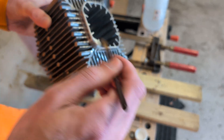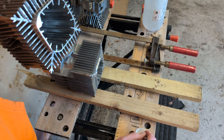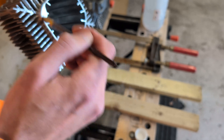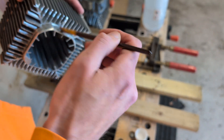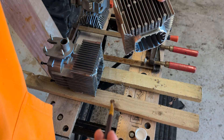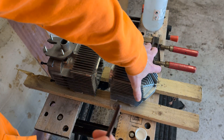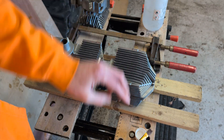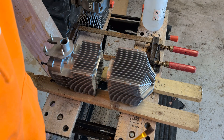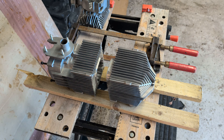If this doesn't work, we can always fall back on me trying to TIG weld, as funny as that'll be. I'm going to let this flash off and then hit it with a blowtorch and just burn off anything that's left. Take that acetone as far away from your ignition source as possible, because is that flammable.